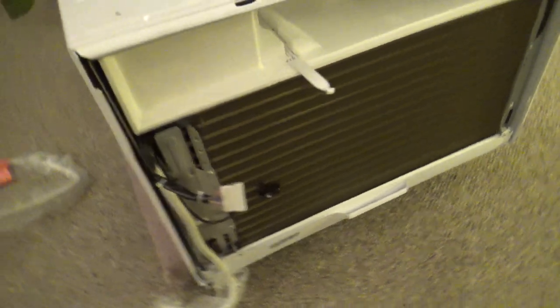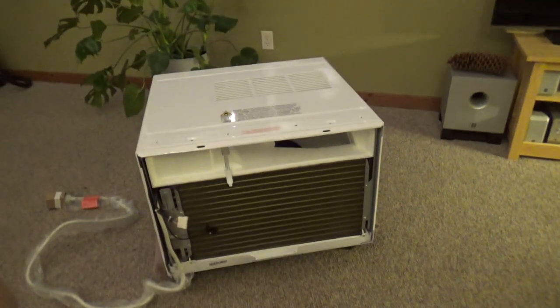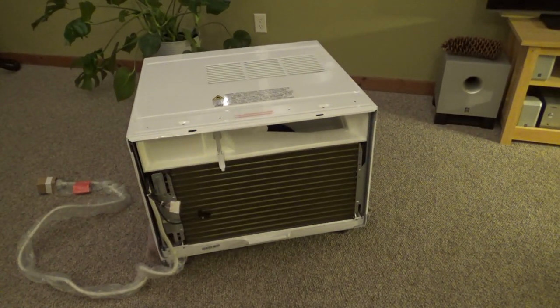It's got a regular squirrel cage blower. Not one of those weird vacuum-and-power looking things. Looks like a ball bearing motor for sure. It's a smaller coil than I would have expected. Looks like it's some kind of copper alloy. The aluminum ones that Carrier used were much better.